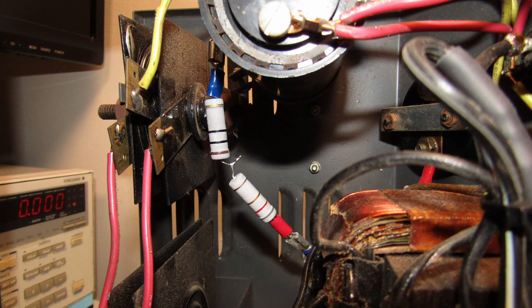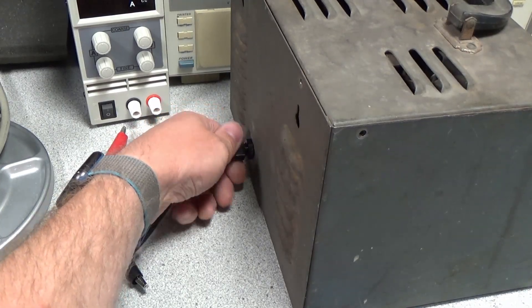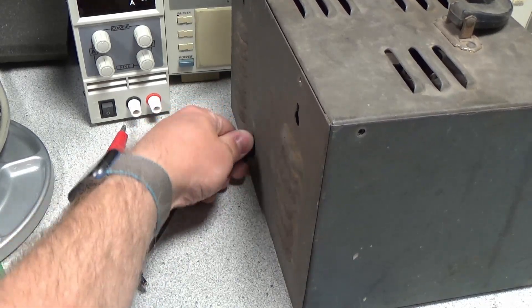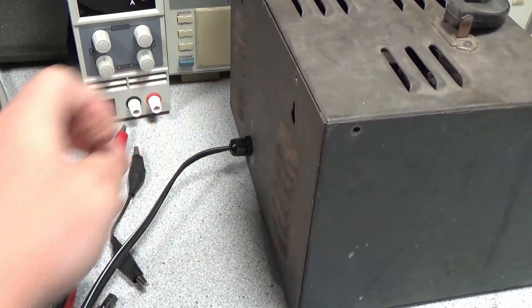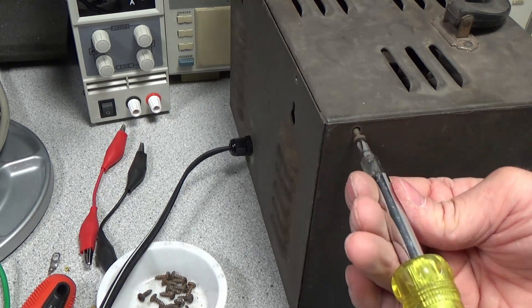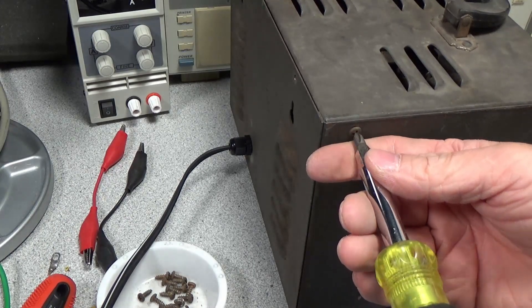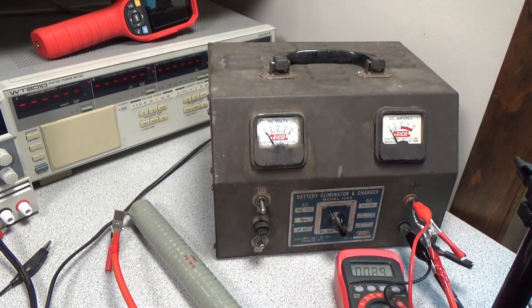I did a final 18.2 ohm resistor adjustment to get the front panel voltage meter in alignment — total about 53 ohms. Finishing touches: the line cord strain relief is installed with its somewhat pointless rubber grommet, but at least it won't get any dust in it. Adding screws — all the original screws, not one stripped screw. Okay, time for some functional checks.